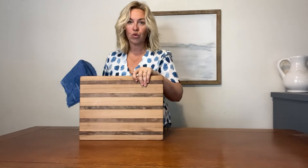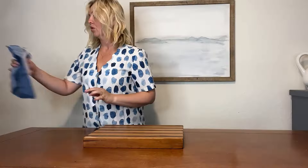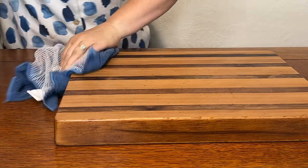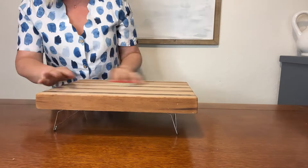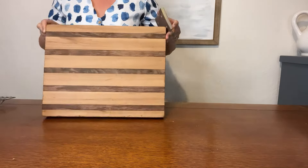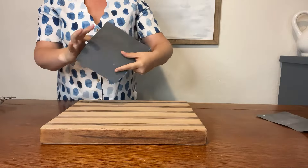Here's the secret to getting a smooth cutting board: you want to wet your piece down again after you've sanded in order to raise that grain. That way whenever you do get it wet again it will be smooth. We will be sanding it down one more time to get it prepped. I'm just hand sanding now, using a very fine grit and following it up with an even finer grit — all the way up to a thousand grit sandpaper. This will give a very buttery smooth feel on your piece.